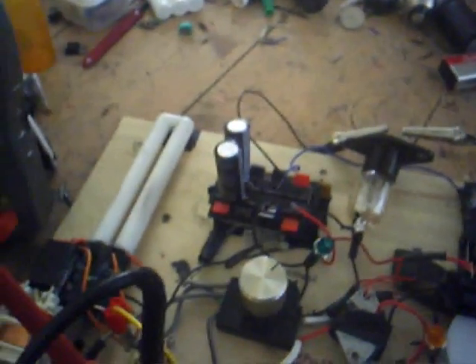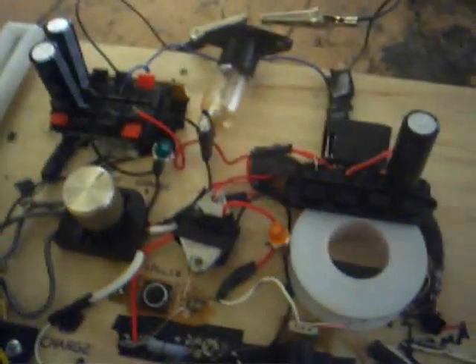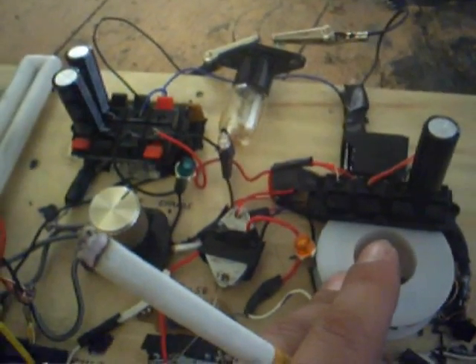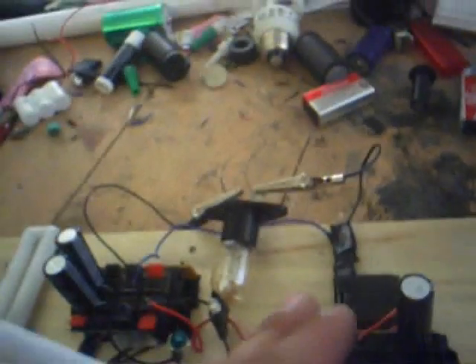All this is — it may look like a rat's nest, it may look like crap, but it works pretty good and it's very simple. I've got a drive coil; this section here is very similar to a Bedini circuit, except I've got a third winding on it. I'm basically using two wires just to get self-isolation and I'm tapping the high voltage across the trigger. I've got a third winding with low inductance thicker wire that's being rectified and charging a capacitor — that's my excess energy, which I'm using to switch this relay for my pulsing circuit.